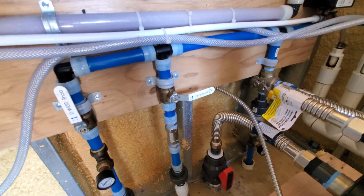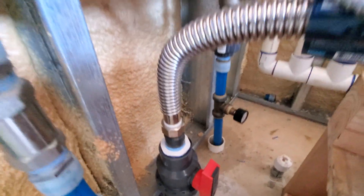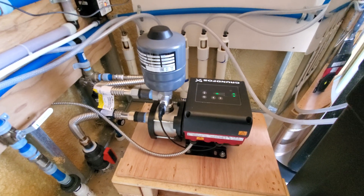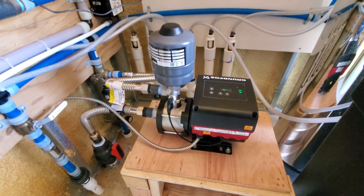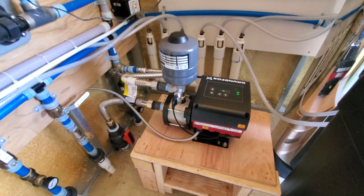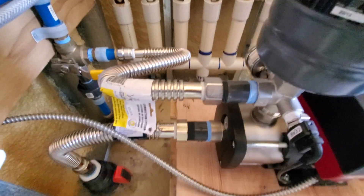The D tank fill valve runs through 1-inch PVC to the top of the tank. The bottom 2-inch pipe comes underground and pops through the slab — another shutoff valve goes in as 1.25-inch flexible pipe into the booster pump. This is a 2 horsepower constant pressure booster pump that delivers up to 35 to 40 gallons per minute as required by the sprinkler system. You have to have at least 1.5 horsepower; we went with this 2 horsepower unit.